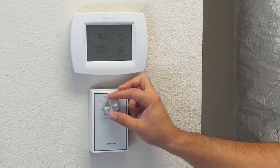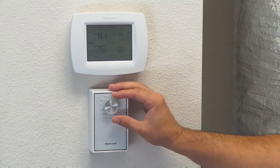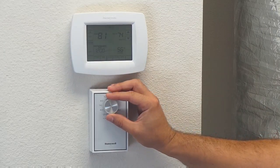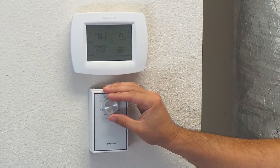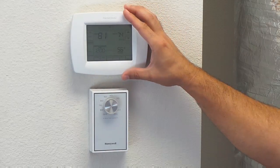In most cases when you go north for the wintertime, you want to make sure that you set this to 55% relative humidity. Now what that does — if your home goes above 55% relative humidity, it's then going to turn the power to your thermostat on.